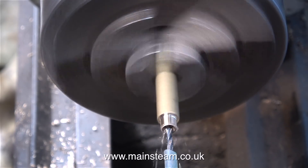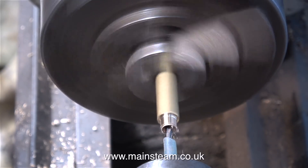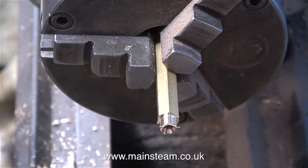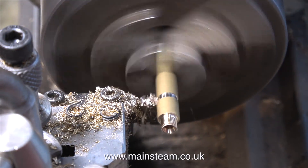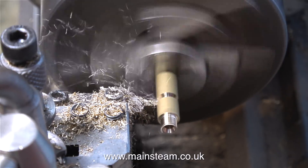I'm now drilling a hole in the work using a number 48 drill, and as you can see it has a piece of fuel tubing on it because this was the drill I used for drilling the holes in the baseboard. It's most important when making union adapters like this not to use too large a diameter drill, otherwise the 3/16 by 40 part will be very weak and you don't want it to snap off in the engine's exhaust port.